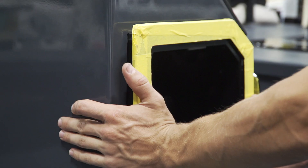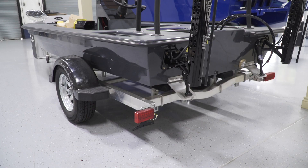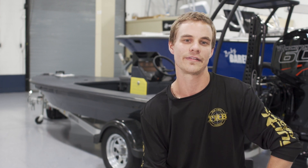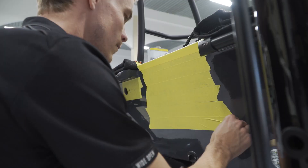It's a really nice boat. Now that we got basically all the wire run and everything rigged up, the last step is to put on the jack plate and the Mercury. To start out with mounting your jack plate and motor, you really want to find your center line. You want to be directly in the center of that boat, so what we like to do when we start off is tape off the whole transom. That way we can mark it up with a Sharpie and make all the marks without scratching up the transom.